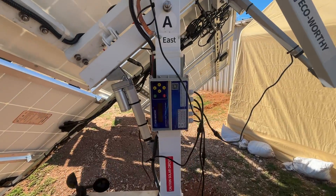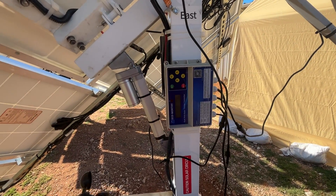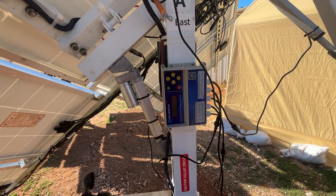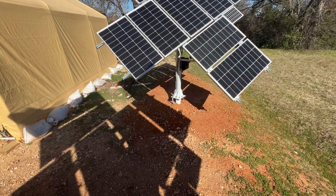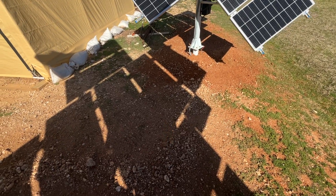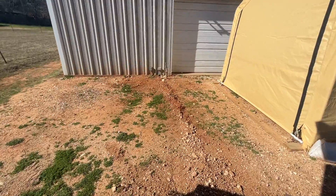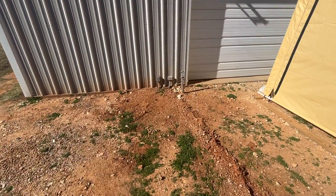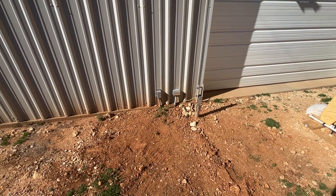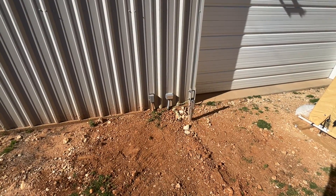This is basically the same control head, though the settings are a little different — I haven't fully figured those out yet and need to do a little adjusting. It's just calibrated a little differently. I used flexible three-quarter inch conduit with eight gauge electrical cable in it, and used a little trencher. I trenched about ten feet from the pole and then over to the building where I have an electrical box as a junction point to enter the building. You'll see two of them there — one is the first I installed and the bright one is the latest.